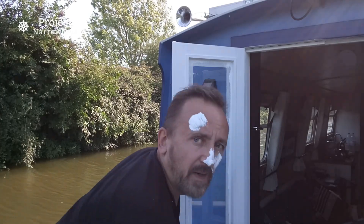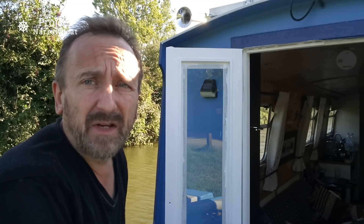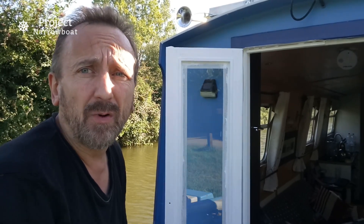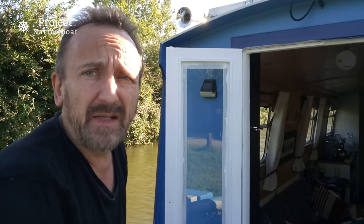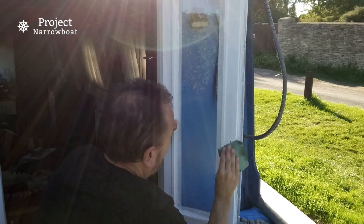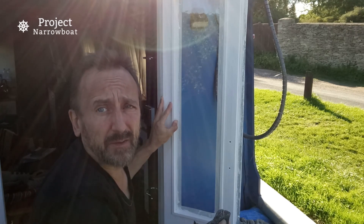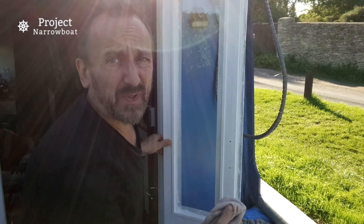Time for the second coat. And that's the second coat done. With the second coat now dry, I'm just going to go over it with a little bit of emery cloth — sandpaper, call it what you will. I think this is about a 120 to 180 grade, just to get any of the worst brush marks out and also any little speckles of dust that might have settled. That'll actually make quite a lot of difference to the finished result. Just give it a quick go with the cloth again to get any bits off.